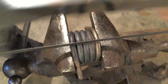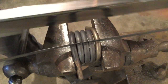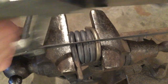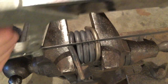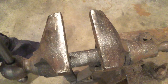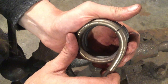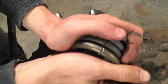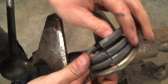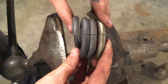As you approach the final cut, just take it nice and slow, because this whole thing tends to fall apart all at once, and that's when the hacksaw starts to bind. That signature squeak — there goes our first part. We're going to relieve pressure. You can see we're still attached; this is still pretty strong. You can break it loose, but I recommend finishing the cut. I could break these open if I needed to, but if you finish the cut it'll be cleaner, and that'll save you more work on the next step.